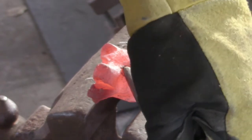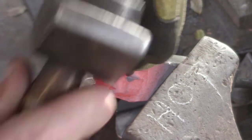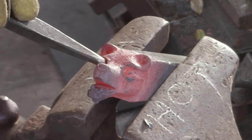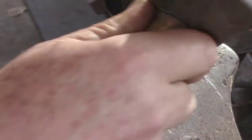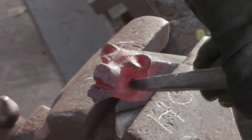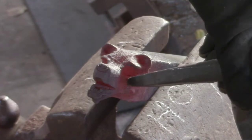Don't do much — just clean up any rag or anything nasty in the eye socket on both sides and smooth out any lumps and bumps. Then we're going to take the eye tool, and I'm going to scallop — notice how I'm doing this in a circular motion. I'm just trying to pull material into that eye. I'm not just driving it home; I'm trying to scallop and scoop material into the eye. I'm using my fuller to get rid of those hard lines at the top of the cheek.